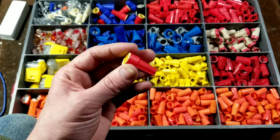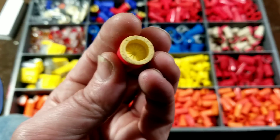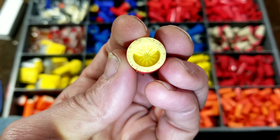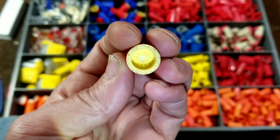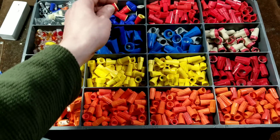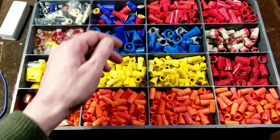I recommend soldering wires on things such as boat trailers, but you can get ones that have a fingered boot filled with silicone or dielectric grease to make them outdoor rated. They do actually make wet-rated wire nuts.